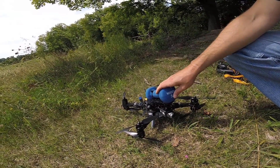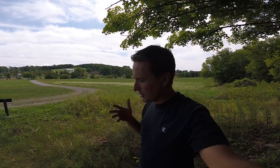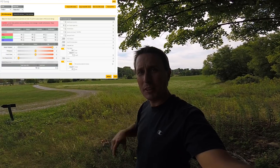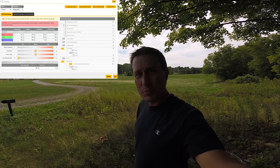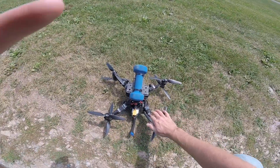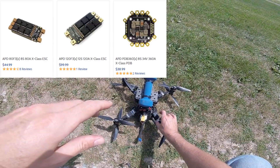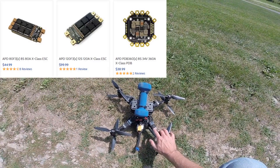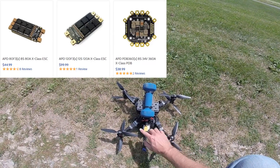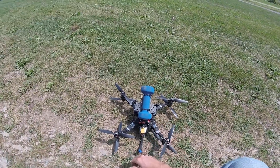This is their design for the frame, but Quad Standard Labs builds drones like this. So I did some preliminary flights on this just to make sure it flies line of sight. Made some tweaks to the PIDs — I'll throw those up in the upper right of the screen. What I did just recently is I moved the master slider up to 2.0, and I want to see how that looks. The ESCs on this are the APD ESCs, and obviously there's eight of them. They're interesting — they have auto timing and auto PWM, so check those out.